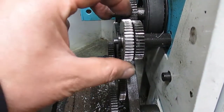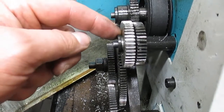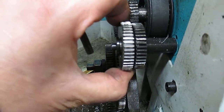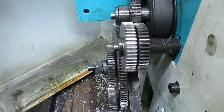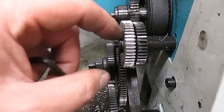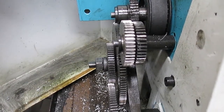As you can see there is a slight gap here, which means this is slightly thinner in thickness than the originals. I think on the originals they had a little boss on either side of the face. So what I might do is just make a spacer to fit behind here between these two for when I actually use it. Worst case I can use it as-is and it will allow me to cut 1.5mm threads until I decide the best way forward — I could get a thicker gear and machine it all again. But for the time being it works.